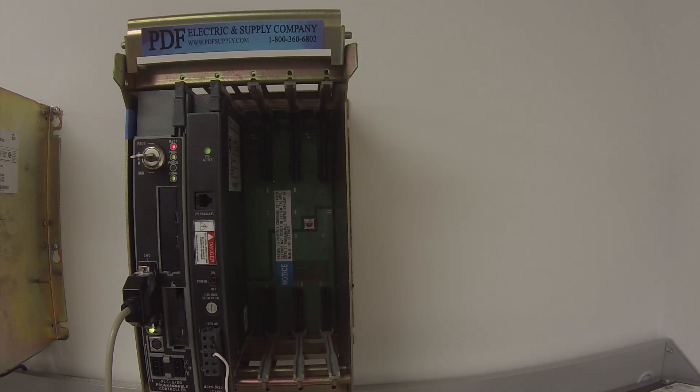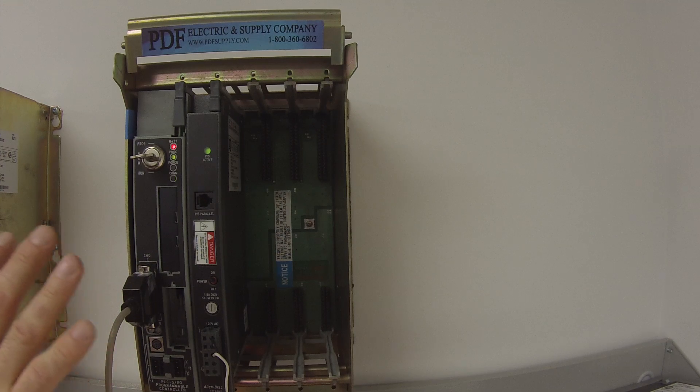To the right of that is process warning, processor warning, program warning, and channel warning — going left to right through the tabs — just checking if anything is reported. I don't have any issues, so I'll close that window. The next thing I'm going to do to test the processor capability is fill the chassis with I/O modules and put some cardboard or plastic on the bottom and top to block the heat in. I do that to increase the temperature on the processor, put it under load, and simulate more of a factory situation where it may fail if there's a problem. We do this for two or three days — usually over a weekend. As long as the processor stays in run mode with no faults, errors, or glitches, we consider it a good solid processor.